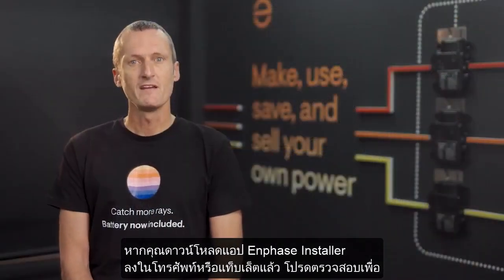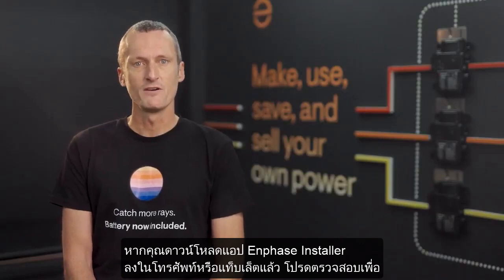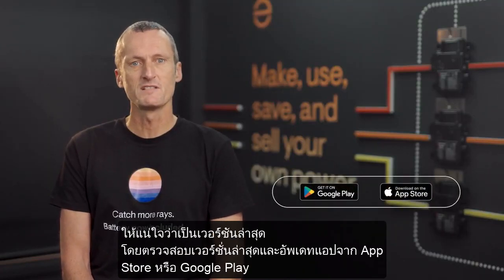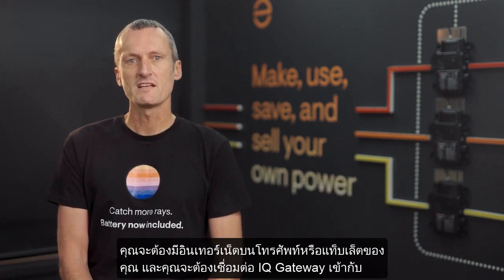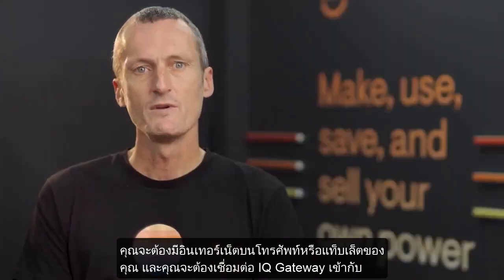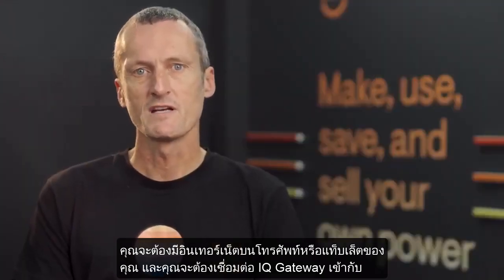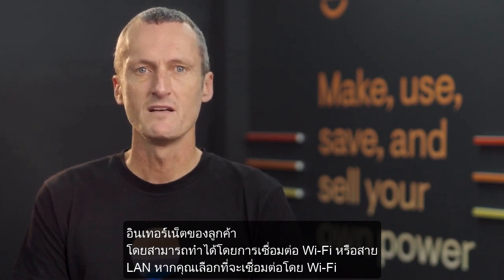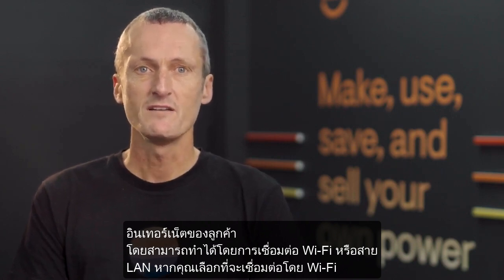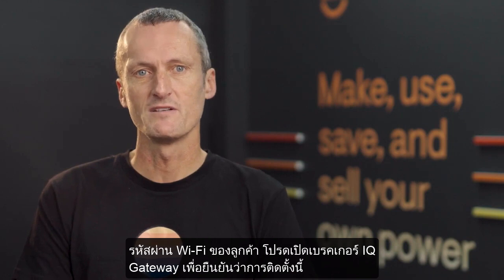If you already have the Enphase Installer App downloaded on your phone or tablet, check to make sure it's up to date. Now jump into the App Store or Google Play for the latest version. You'll also need internet access on your device. You will need to connect the IQ gateway to your customer's internet. You can do this via Ethernet cable or Wi-Fi. If you choose Wi-Fi, you need your customer's Wi-Fi password.